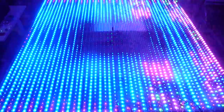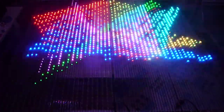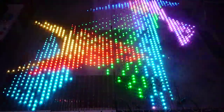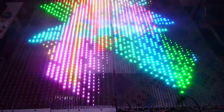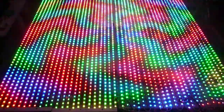This is four LED panels; each panel is 56 by 12, so this is a 56 by 48 matrix. The two panels on the right are the new panels I just finished making, and the last two universes of each panel are still a little flickery — I'm not sure what's going on there. That is a lot of pixels: 16 universes.